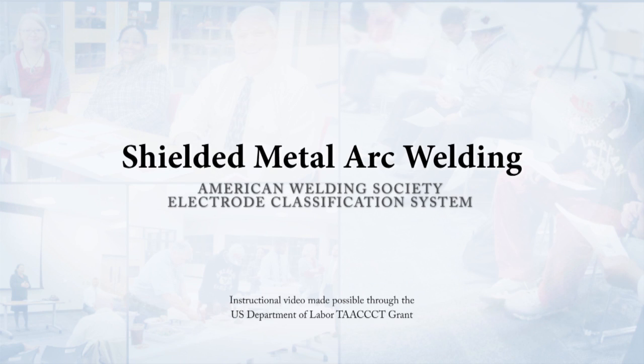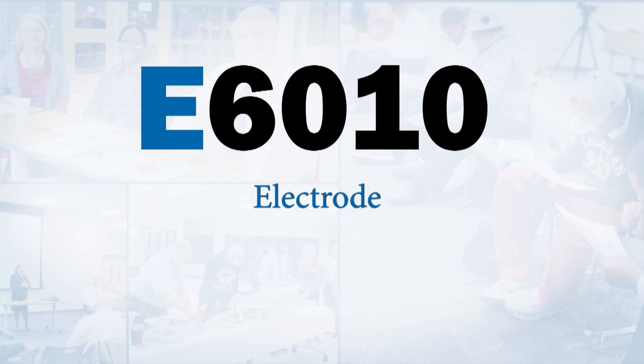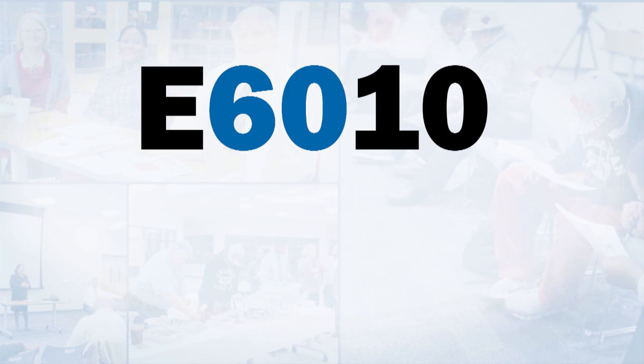Today we're going to be talking about the American Welding Society Electrode Classification System for Shielded Metal Arc Welding. This is a typical Shielded Metal Arc Welding electrode classification. We have an E for electrode, which means it carries current. The 60 is for the tensile strength in thousands of pounds per square inch, or KSI.